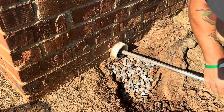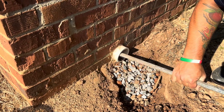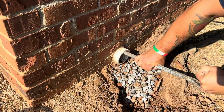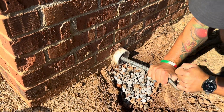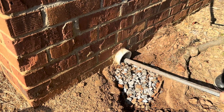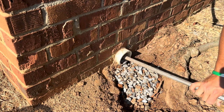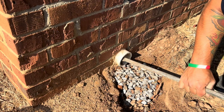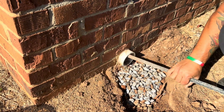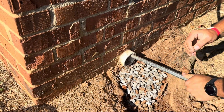The minimum requirement on a suction pit is two gallons of media to be removed. There's no suction pit here. Part of the reason this doesn't work is there's no suction pit. Now, there's gravel so air does move through it, but this would operate a lot better with a proper suction pit. So we're going to clean that out and create one.